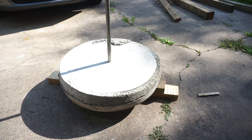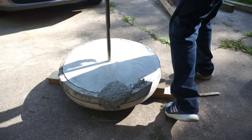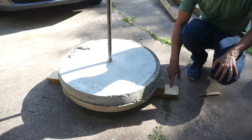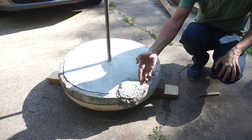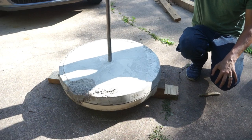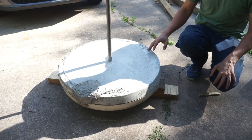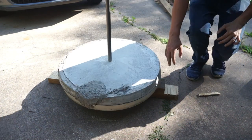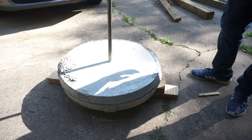It took some doing, but I got it on there. And you can see that I was a little bit off on my depth of cut on those lap joints. But this is spinning really well, just all on its own. So that flange bearing will go up here, and then we'll dress this wheel so that it's all even and balanced before we really get it spinning up. But just by itself, that spins for a long time. I'm really pleased with that.